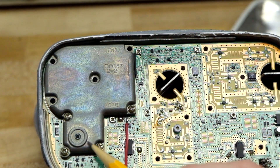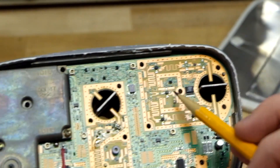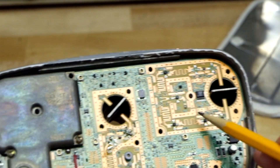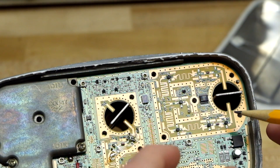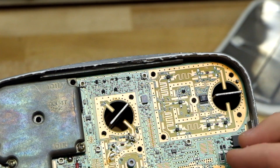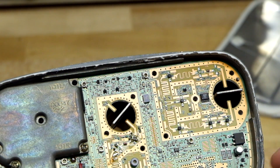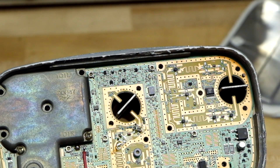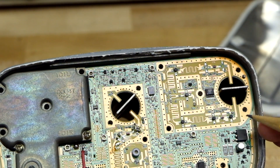One DRO is here and the other is underneath, with some coax connecting it on the back of this PCB all the way up. What I did on the modified side was take the transistors and rotate them 180 degrees so the gate was where the drain is and the drain was where the gate was. Then I just cut a couple of traces and soldered a couple of things so that the biasing circuitry is connected properly — biasing the gate and drain so they're mid-rail on the 12 volts I'm powering this with. What you end up with is one side capable of receiving and one side capable of transmitting.